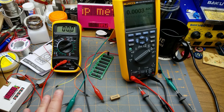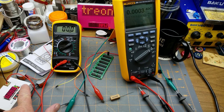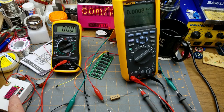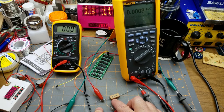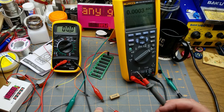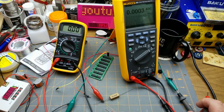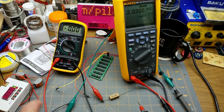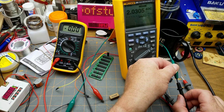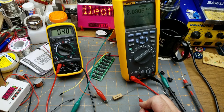Let's set up something high current. I've got this power supply set to a 2-amp current limit at just about 11 volts. I have a 0.47-ohm, 5-watt resistor so I shouldn't cook anything, both meters on the full 10-amp mode. The Fluke reads 2.03 amps — and the cheap meter reads 2.04, 2.03. That's pretty good actually, and it didn't seem to explode, so that's good.